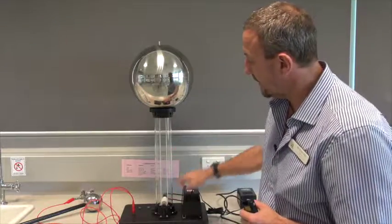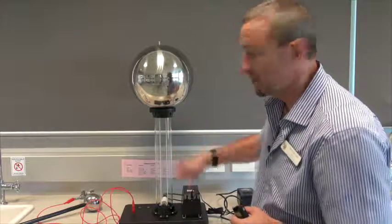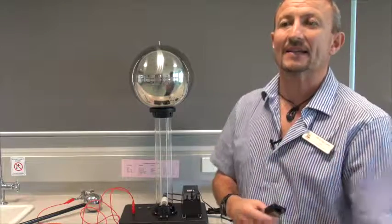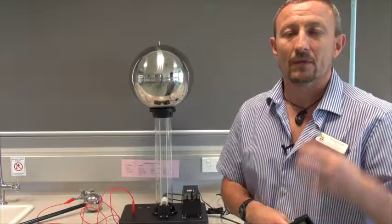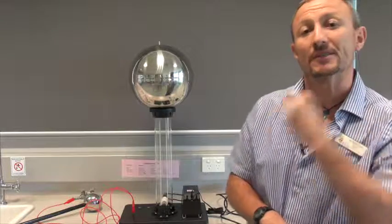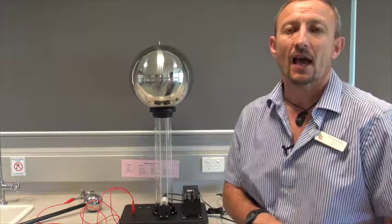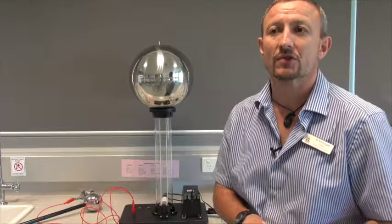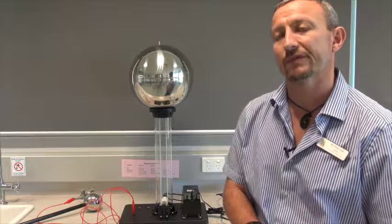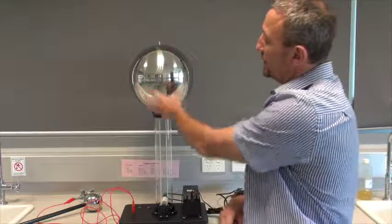On the inside here, basically what we've got is a rubber band, and we've got rollers which cause the rubber band to move. Now basically, as I stated, it produces low currents but large amounts of charge. The potential difference achieved in these Van de Graaf generators can in some cases reach up to about 5 megavolts. But this tabletop version will probably go around about 100,000 volts. So that's 100,000 joules per coulomb, which is generated on the top.